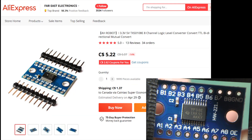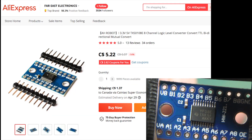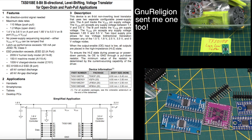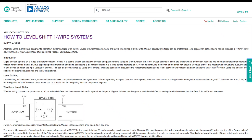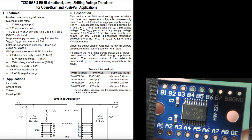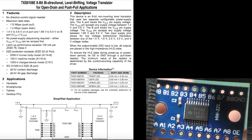This one here is an 8-channel bi-directional level shifter. This can level shift both directions between 1.5 volts and 5 volts. I thought in some cases it may be better to have a dedicated chip solution like this than some of the other level shifters where it's just a FET configured in clever ways to achieve level translating. Sometimes a stronger push-pull circuit with an output enable is the better way to go.